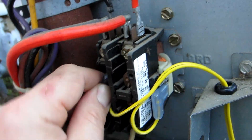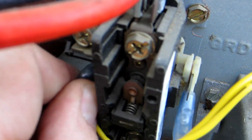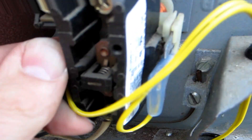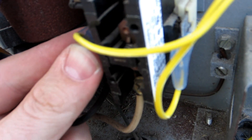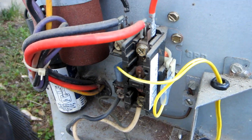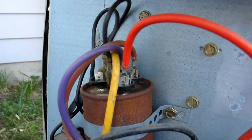The other thing I've taken a picture of is that this coil has a pitted contactor. If I were doing a service call on a customer's house, I would tell them that the contactor probably should be replaced, which would be about $99 for most companies.